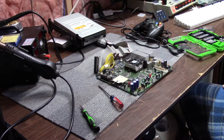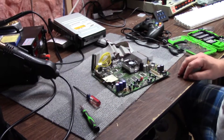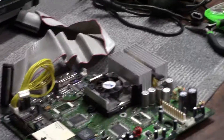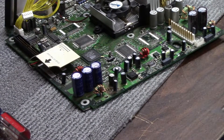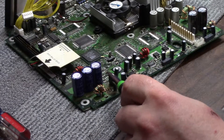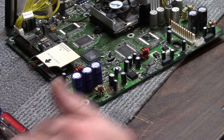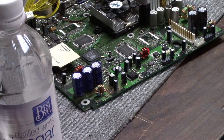Just set it down so we can get a better view. I'm not worried about the mod chip in the device — we're not supporting that in any way, it was just in the device for the repair. You'll have three main capacitors — they're 16-volt 1500-microfarad capacitors. The one we want is this piece-of-crap Sensi; it always leaks from the bottom. You can see it looks like total crap. Now we need to neutralize the acid.